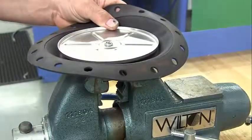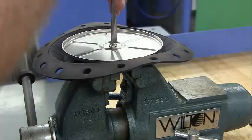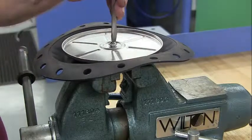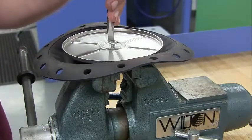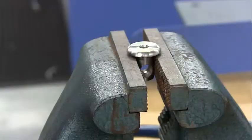To replace the diaphragm, place it in a vise and using a flat head screwdriver, remove the screw and lift the plate apart. Although it did not need to be done with the Mark 608 in this video, you may need to clean the surface of the upper and lower diaphragm plates. You may also need to clean and degrease the threads on the lower diaphragm plate and screws with Loctite Primer T if they look dirty.